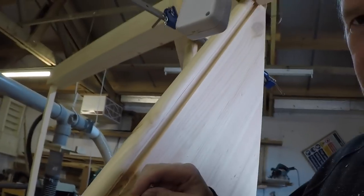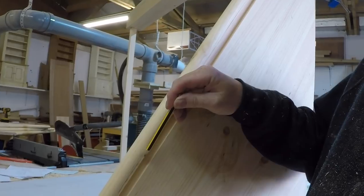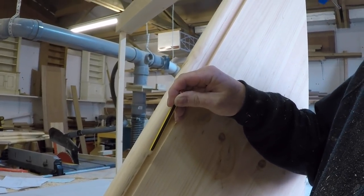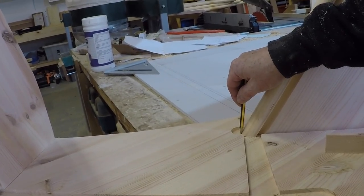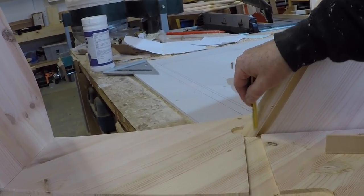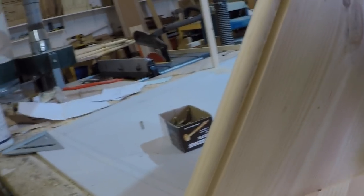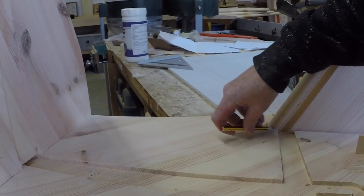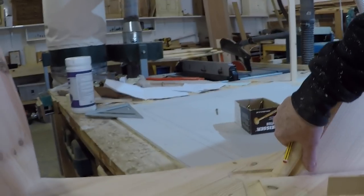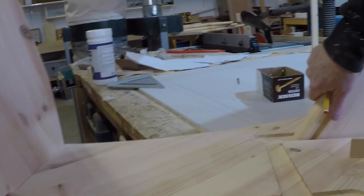Right, from here to here is 21mm - that's the overhang on the tread. But on your winders, from here to here it's about 25 to 26mm - it's longer because it's on an angle cut. So here's what I do: I put it forward, get my pencil and go like that, and I take off the first 5mm so that as it cuts in, it fits.